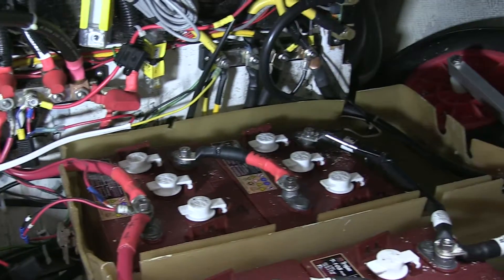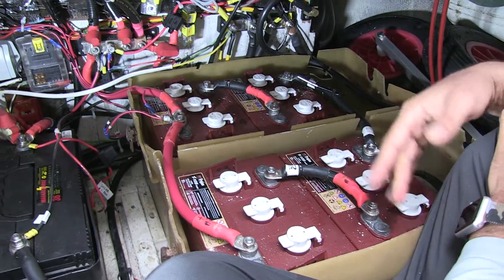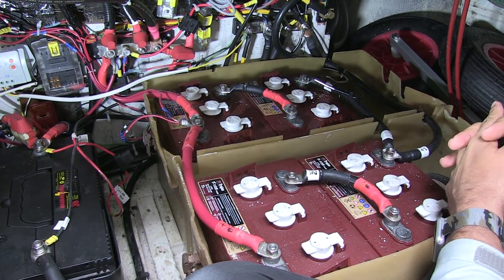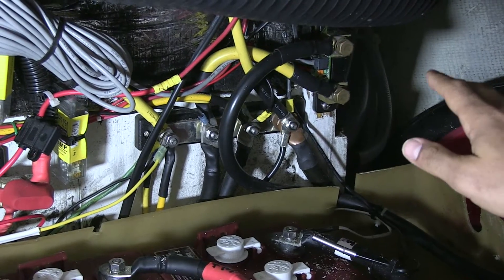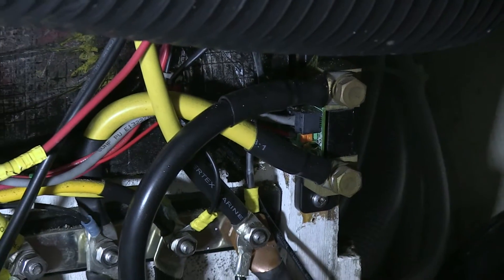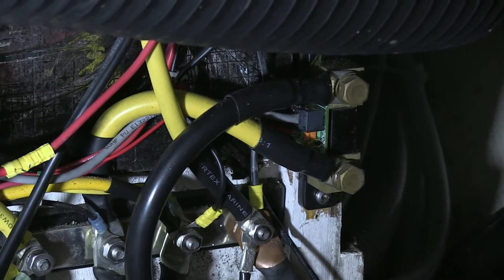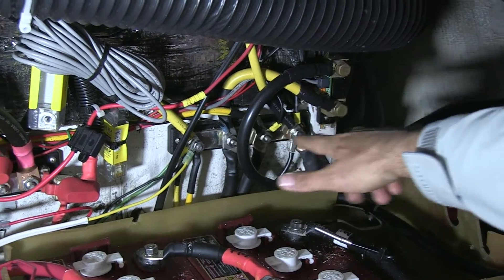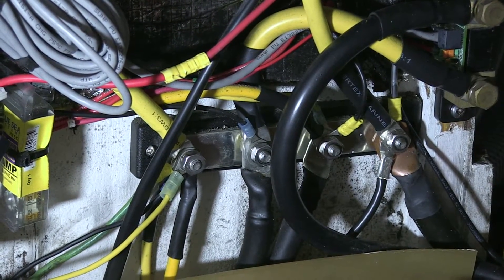You can also notice the batteries are in a container, which is great, and I'm not seeing any signs of electrolytes on top of the battery. That tells us the batteries have not been overcharged or overfilled recently. Next, looking at your negative distribution — the first thing I see is a shunt right over here. This shunt is basically a single choke point used to measure all the current going in and out of the battery bank. Good news is I can tell you don't have any negative connections bypassing this shunt. All the current goes through this cable, comes out, and feeds a negative distribution common bus.